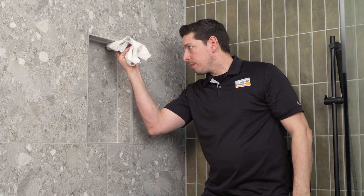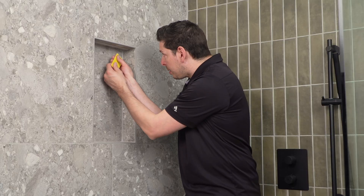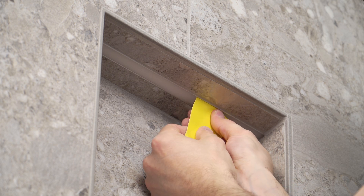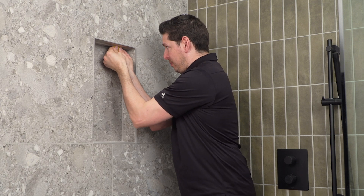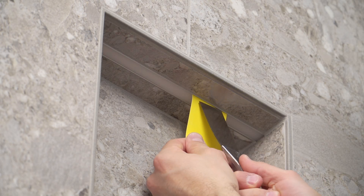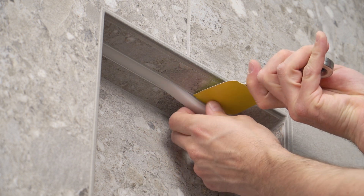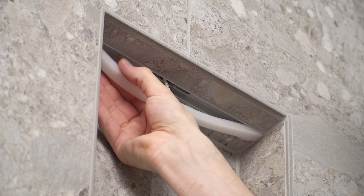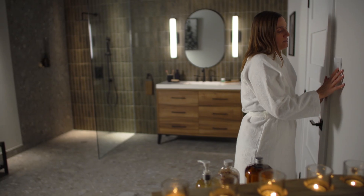Fill in any gaps at the end of the LED above the tiles with grout or sealant, then clean the LED. If removal is needed and no tab was used, a thin plastic card can be inserted between the sides of the LED and mounting profile to protect the LED strip from damage. Once this is in place, a 1.5-inch putty knife can be used to pry the LED out of the profile far enough to grab it — the blade of the knife should be inserted between the plastic card and the side of the profile. Use care when doing so to avoid causing any damage to the LED strip. The installation of the system is now complete.